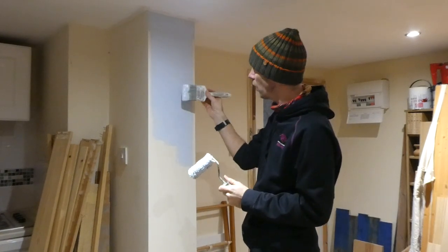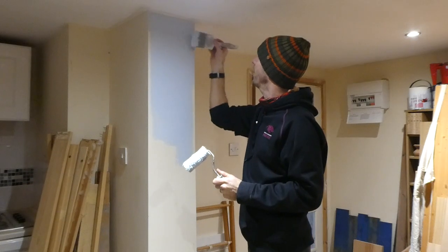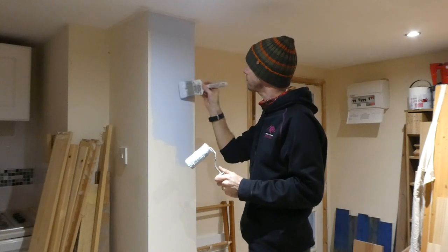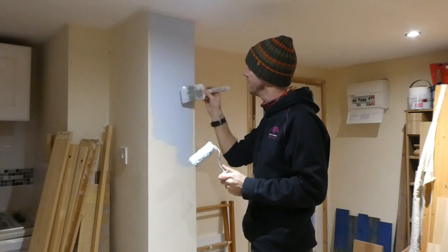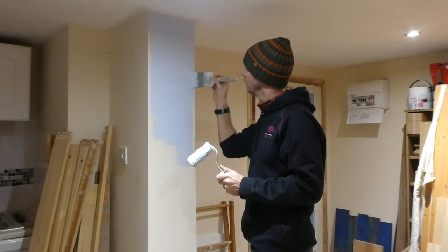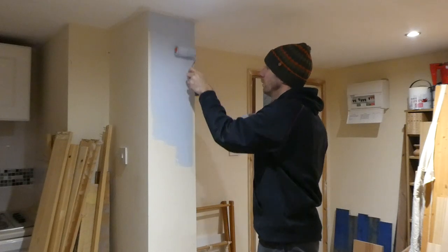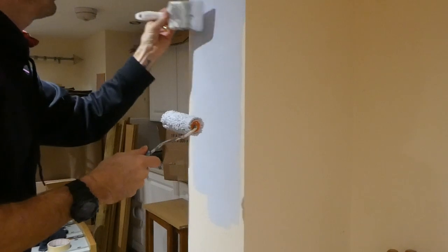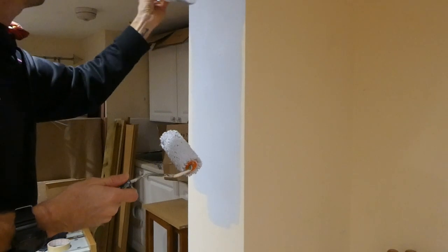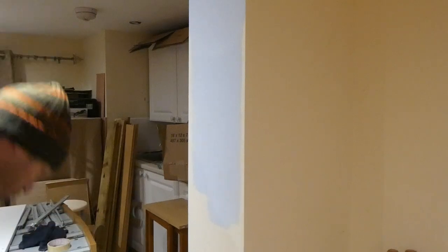What I don't want to do is hold the brush at 45 degrees. I'm literally just going to keep it as flat as possible so the bristles aren't flicking as they come off the wall. All they're doing is staying quite straight and just dragging some of that paint across that section where I missed it with the roller. Once I've got to there I'll get as close as I can with the roller, keeping that brush nice and flat. You can probably see from this angle how flat I am keeping it — just ensuring there's no flicking of the bristles as it goes off the other end.